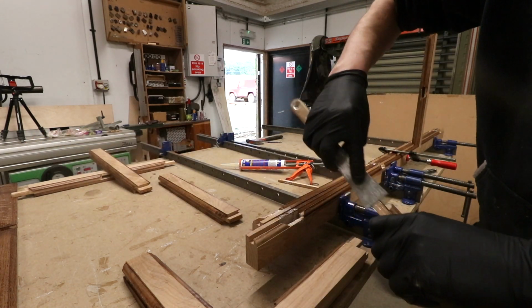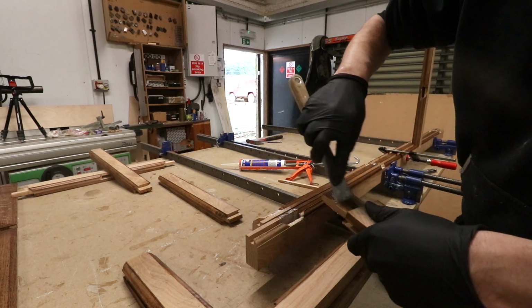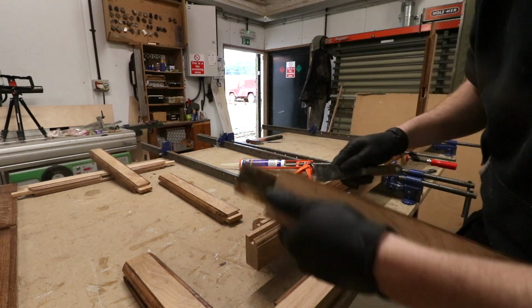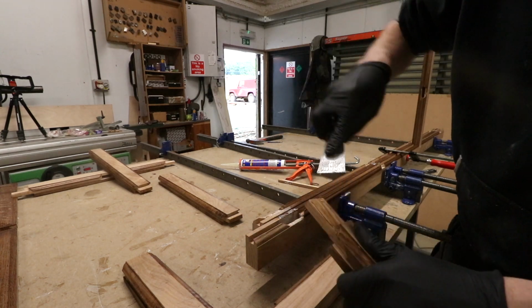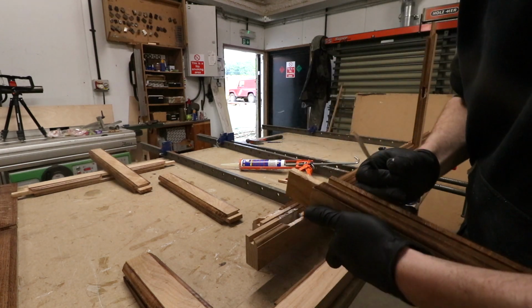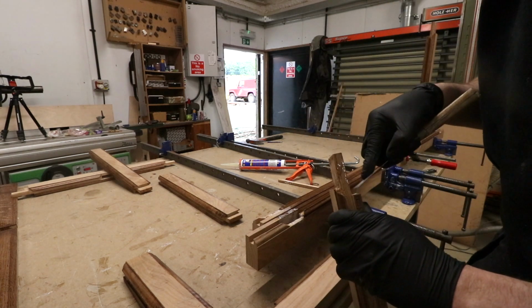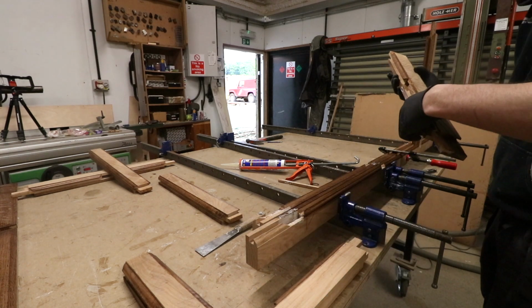Especially if you've not been working on them. You know, if you did the panels a bit earlier in the job and then you've been sanding and stuff and put them to one side. You're so used to gluing up doors that are just glazed and not got panels in. It's dead easy to miss them or forget about them and get a bit carried away, and you've glued your door up without the panels in it. And there isn't really a lot you can do from that point on, other than cut the grooves out and bead it. That's not a very good job, is it? No.